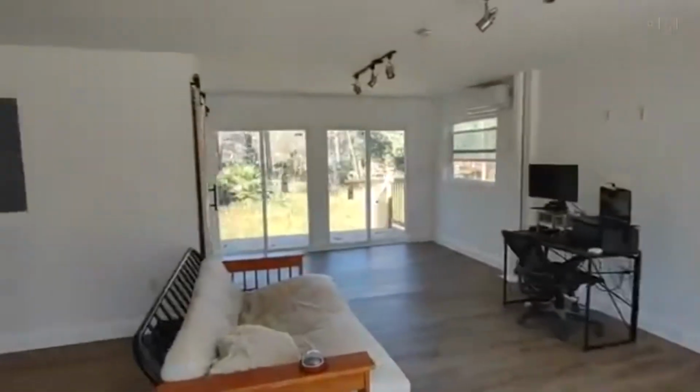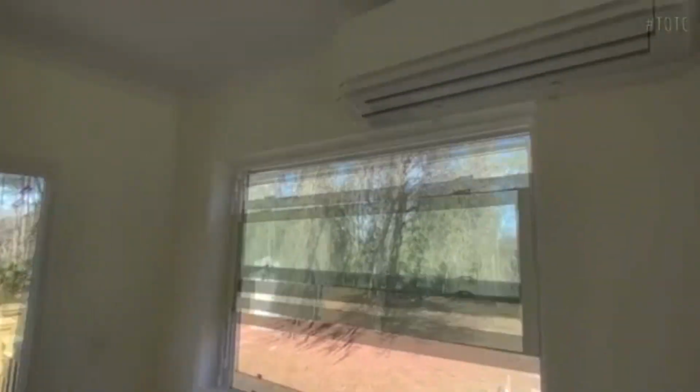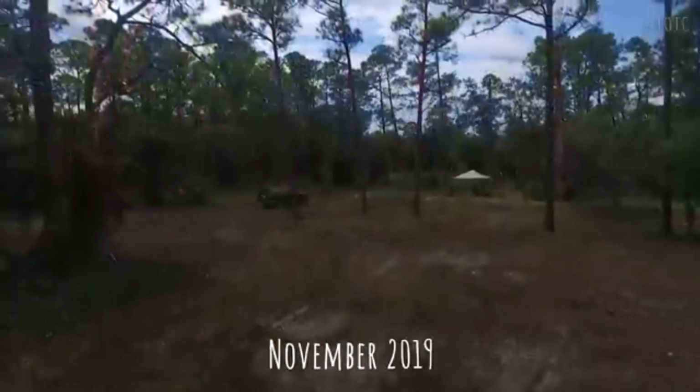We follow the other one, the cold. It comes up here, a 1/2-inch by 1/2-inch by 1/2-inch 3-way SharkBite branch. It comes up here and supplies the water line for the refrigerator in the kitchen, but it continues. It comes over here, and of course supplies the cold water for the clothes washer.